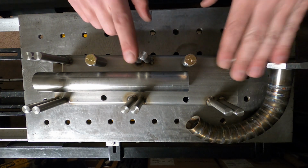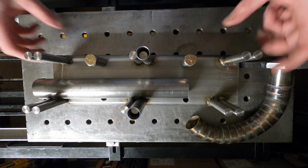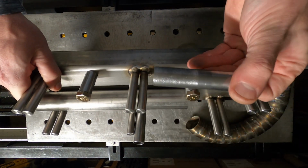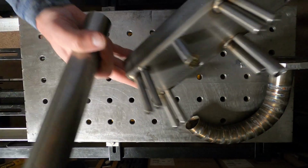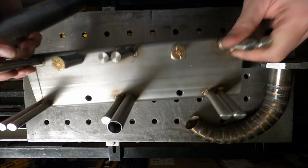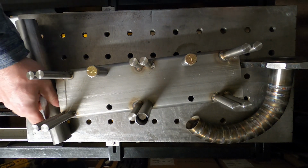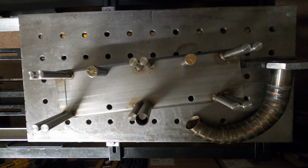One of the things you're going to want to look at, though, when you use this thing is when you got the portable bandsaw going through here, put a sleeve on 2 of these so it rolls. You'll notice that it's pretty beat up on that one part. Well, that's a lot better than the huge nick that's in the side of here when the bandsaw decides to just go walking down this sideways. So it also tightens up the blade groove a little bit too, and it gives you something to back up to. But hopefully this really quick build and video is good enough for right now.